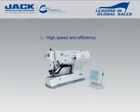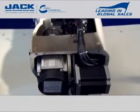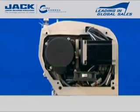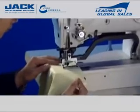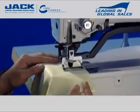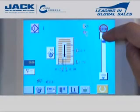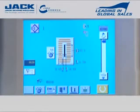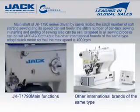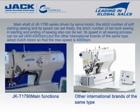One, high speed and efficiency. The main shaft of the JK-1790 series is driven by a servo motor. The stitch number of soft starting sewing and its speed can be set freely. The stitch number of bar tack sewing at the starting and ending of sewing can also be set. Its speed in the whole sewing process can be set from 400 to 4200 RPM. But the other international brands of the same type adopt a clutch motor, so the max speed is 4000 RPM.